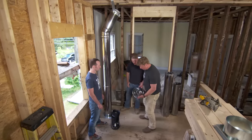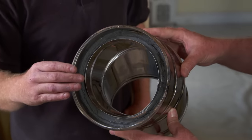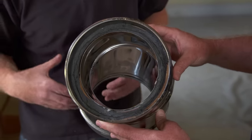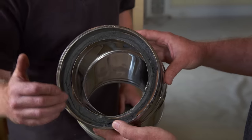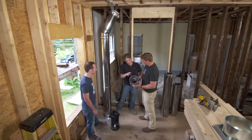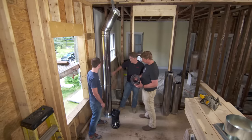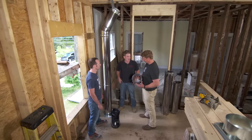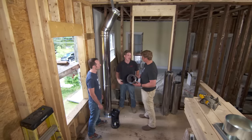And what's so magical about our chimney pipe? Our chimney pipe — once again — we've got a 6-inch stainless steel inner pipe, an 8-inch outer pipe, and there's actually high-heat insulation within this pipe. So what does that do for us in terms of offsets? That allows us to have a 2-inch clearance to combustibles. We can get quite a bit closer to framing materials. It's also maintaining the heat inside the chimney to ensure a much better draft.